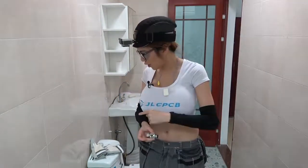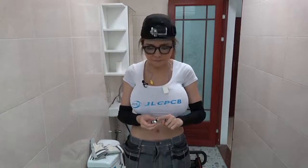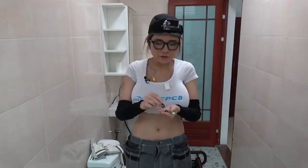I have this T-connector here. There are three holes — one inlet for the wall and two outlets: one for the toilet and the other one for the bum gun. It's very important that this rubber O-ring comes in the plastic bag. I don't know how it is in your country, but it's very important to put this on the hole first, otherwise it will leak. So make sure you get this if it doesn't come with the T-connector.